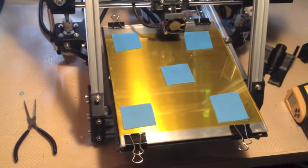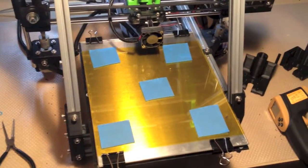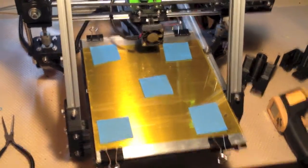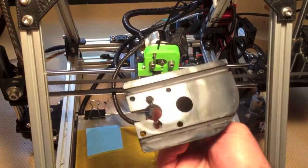Overall, a very good change. It's really giving me better printing, more consistency, and a lot less curling and lifting of the ABS prints — which allows me to print without using a brim or a raft. And I can print out beautiful parts like this.